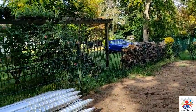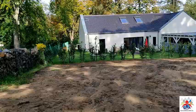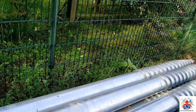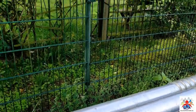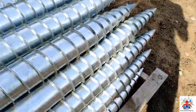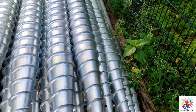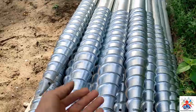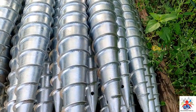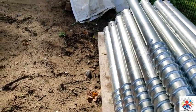Basically they put boreholes in the ground and then they put these kind of items — this one is a big nut or ball type of nut. You can see there are some different parts of this steel item. Basically that goes into the ground, maybe 1.5 to 2 meters. Then on top of that they make a platform, like a wooden platform. This is normally used for a wood foundation, I would say.